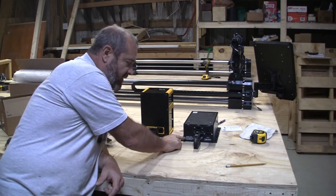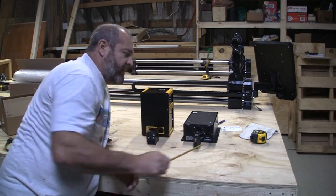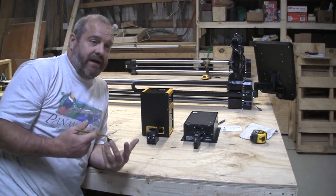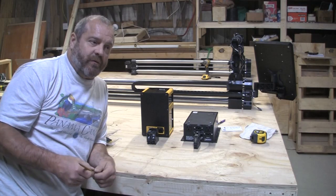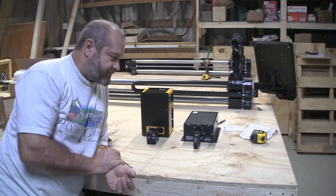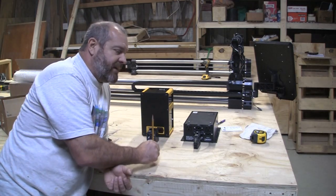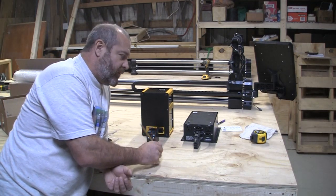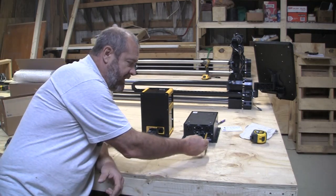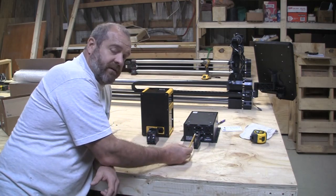I just wanted to call this out about this plug needing to be on its own power breaker, because I'm trying to do this to help everybody else that's getting information. Because when I was looking this up, there's a lot of information from Onefinity, but there's not a lot of information from other people about how to set this stuff up. So if you are setting this up in your garage, you do have a vacuum set up out there and whatnot you got going on, you may need to put an extension cord to get this to a different breaker than this guy is on.